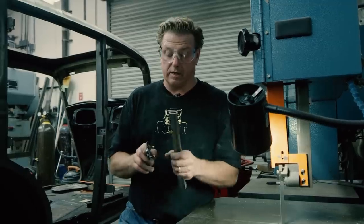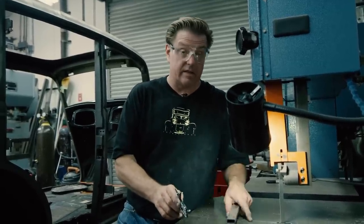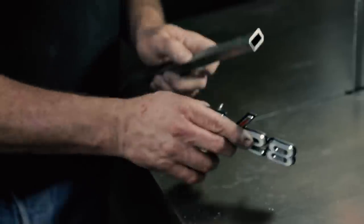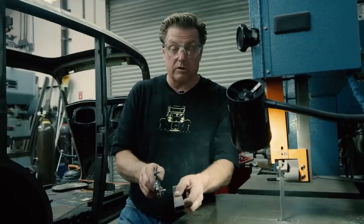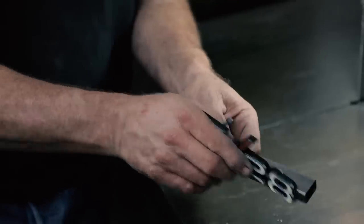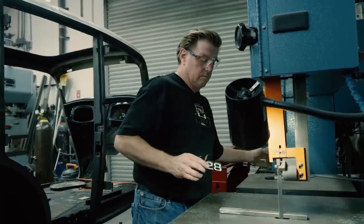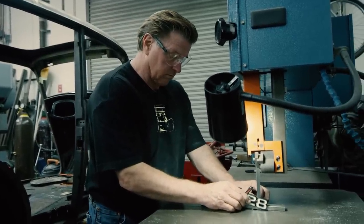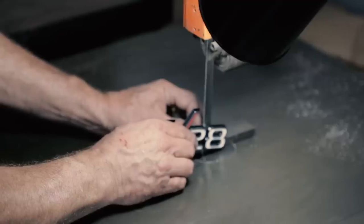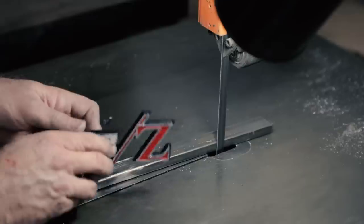Here's a little trick when you're going to cut a post off the back of an emblem or something else that's not flush or flat against the table on the bandsaw. I don't want to cut it directly because the blade can actually want to force it in. So I'm going to use this piece of tubing, set that right there, run it across the blade, and get rid of the post. Real simple — do the same thing with this one.